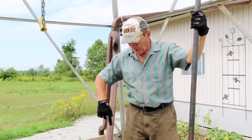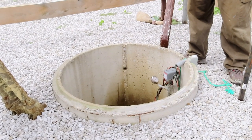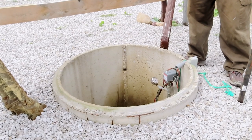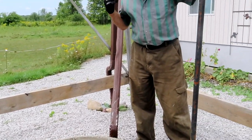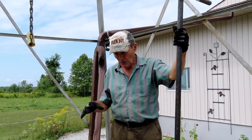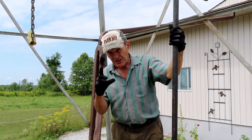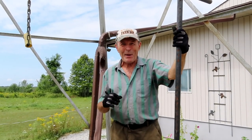Kevin is showing you a picture of the dug well. It's 50 feet deep. I dug this well and put those tiles in — that was a heck of a job, but I was a lot younger then too. Now down at the bottom of this well, 45 feet down, we have a submersible pump and a standard one-inch water pipe, plastic PVC pipe, coming up to a pitless adapter.